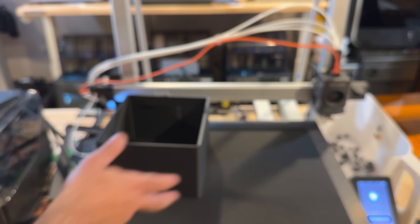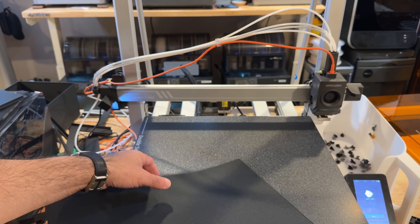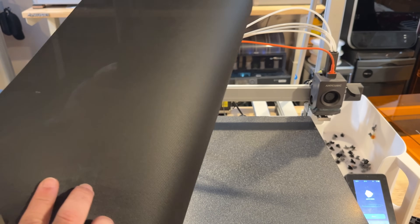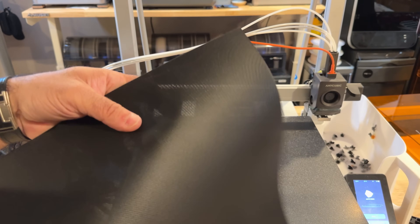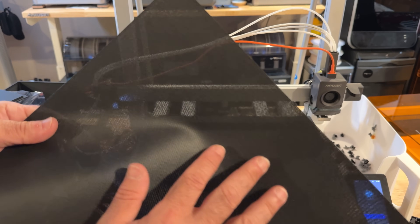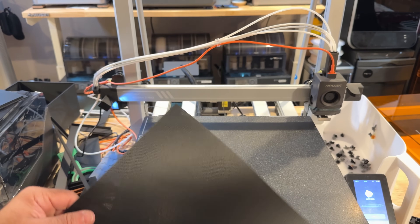We did a full first layer test covering the entire bed. I've seen better, but this is not bad. The full first layer came up completely with no defects or deformation. You'll notice some transparency — it almost looks see-through — and I'd like to see it tighter. But what I also noticed is a nice finish in the center, while toward the corners there are some wavy lines on the sides, so that's going to require some tuning.